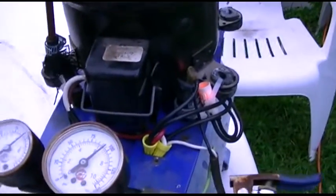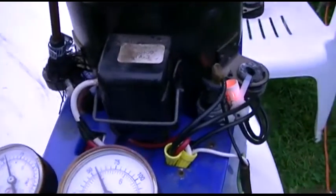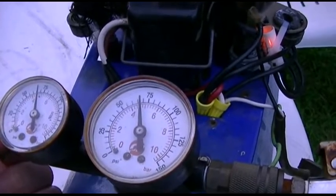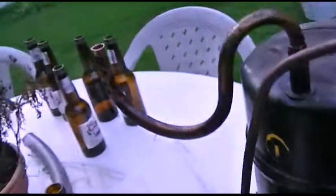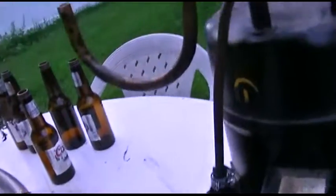Because if I hit it at just the right time — if I pop the valve as soon as it hits the shutoff and it goes right down to 75, without a chance for anything to bleed back and leak back through into the compressor, it starts right back up. I'll try that just for shits. See if I can catch it in time — I've got to do this as soon as the light goes out, as soon as it shuts. And there you go, it's back on, it's running.